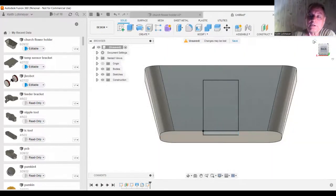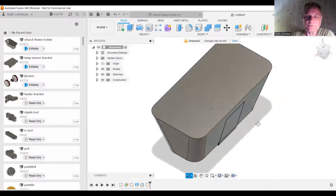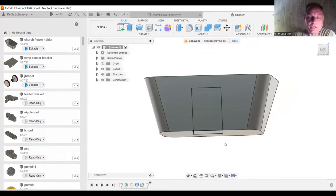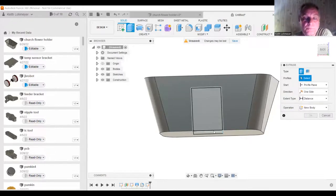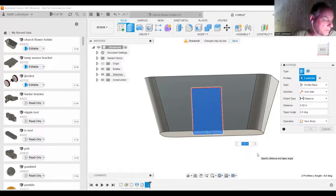I like to go to home view. We have this sketch and it looks like we didn't fully dimension it, but I think it'll work just fine. We want to extrude this in, which is a cut. You can use the E hotkey for extrude. We want to select this region plus the small extension at the bottom to avoid that triangle. Because we want to go inward, we go in a negative direction. Let me measure the depth with the calipers — using the depth gauge end.